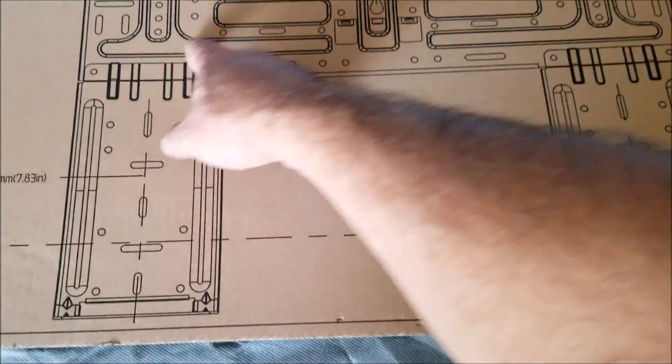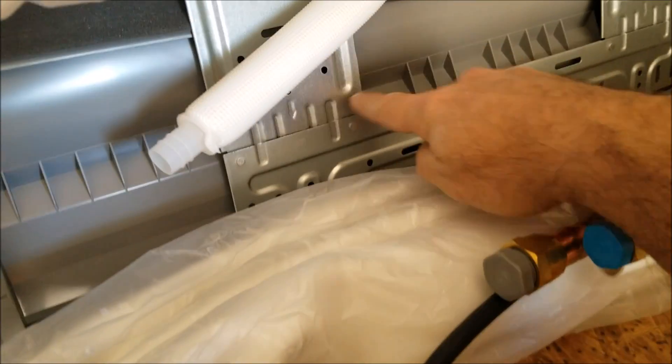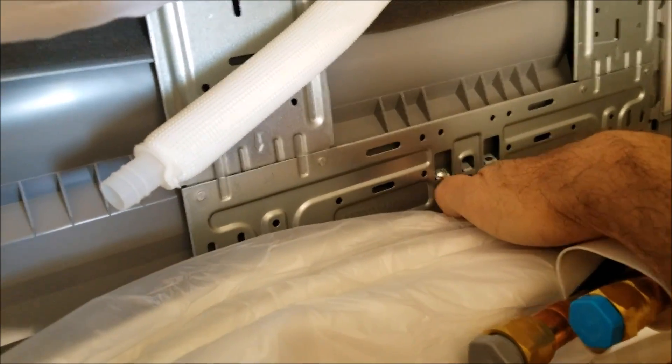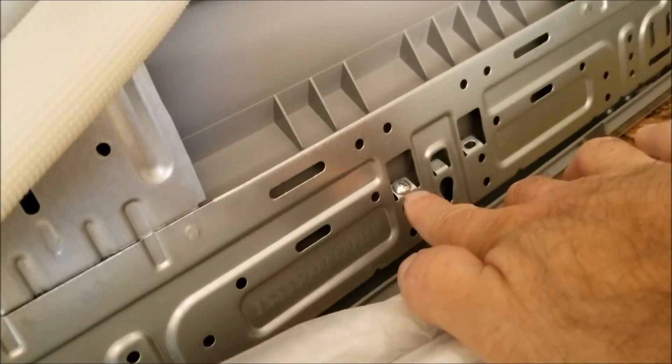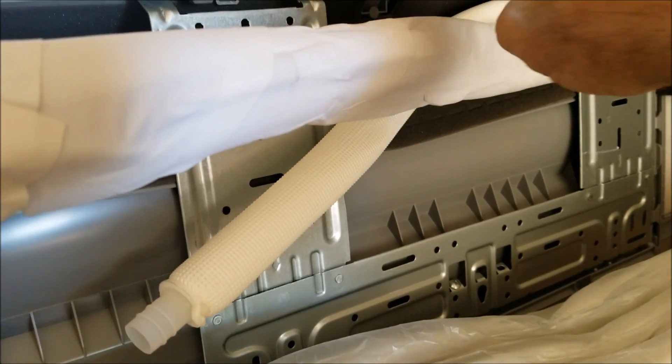There's a plate that you mount on the wall — it's currently mounted on the back of the unit. I just need to pop out one Phillips screw and take the plate off, because that's what the whole inside unit is going to sit on once it's mounted up there. I'm going to find some good studs to screw it onto and figure out where I need to drill my three and a half inch hole. I'll be right back.